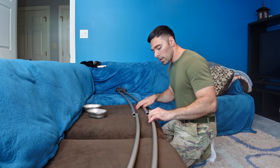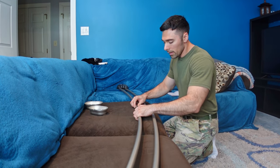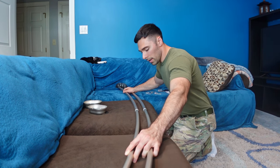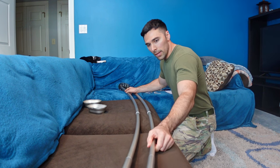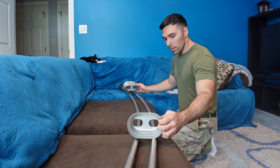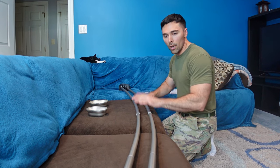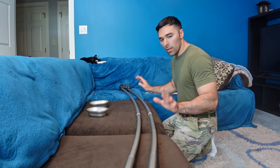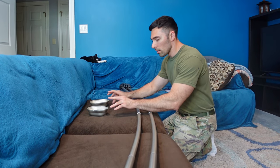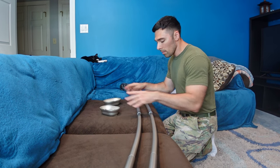Both sides are now fully assembled. Side B's flat side is pointed downward, so I'm going to gently slide them into side A and collapse the bars inward a little bit so I can get this into the bathroom easily. The instructions say to put the end caps on at this point, but I'm not going to do that. We're going to carry it in, put it up on the wall, and use the brackets to mark our final mounting location — so the end caps will just dangle for now.